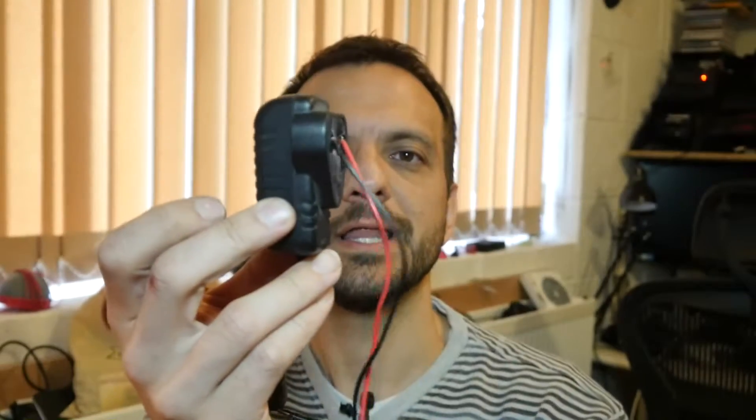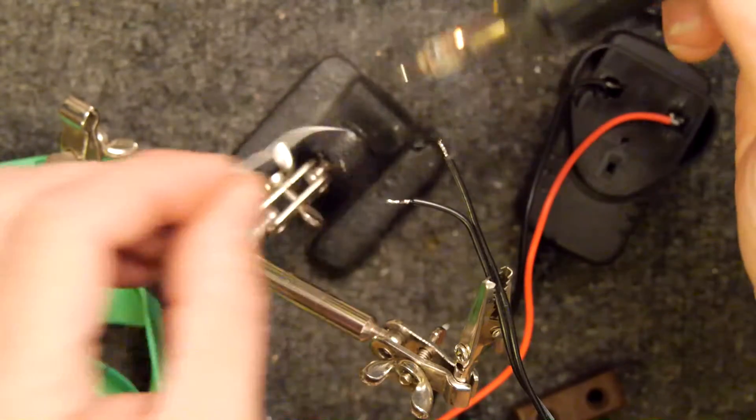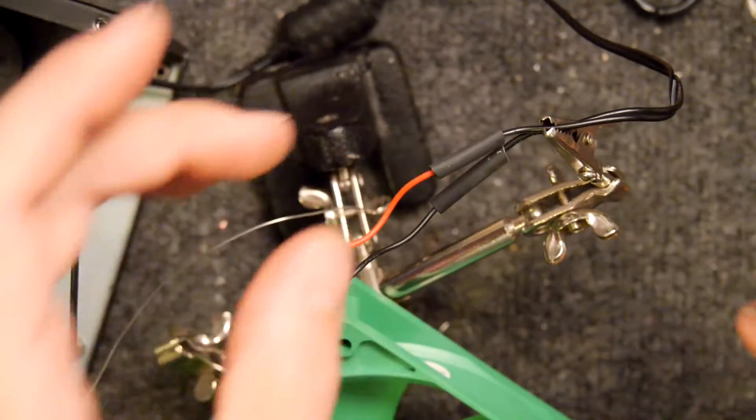You might ask yourself when you're doing this — is it a bit dodgy, a bit jury rigged? Yes, maybe. But be very careful — you're dealing with mains, make sure everything's secure in the case. It's kind of a system integration project. Rather than working from first principles and trying to put in nice PCBs and things in the box, it's quite legitimate to use things like this plastic enclosure in its entirety. There's no real negatives with using this. There's a fan in the box, it shouldn't overheat. It's designed to not produce too much heat. You're only using a small amount of current from this. So if you can just mount all this on a nice resin bed and pot these so it's electrically safe, you'll get no issues with it whatsoever.